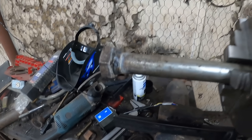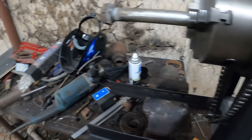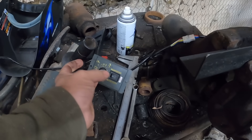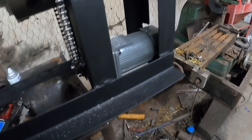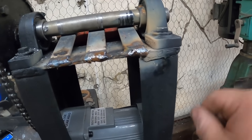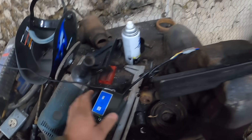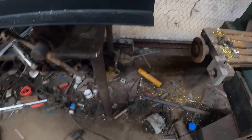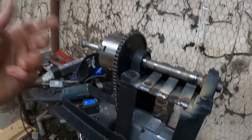It's a little cold and everything, but the weld looks terrible as far as appearance goes — however, the machine did what I wanted it to do. I should be able to just pick it up and carry it around and set it wherever. The only other thing I've got to do is get a box — the holes in the front are actually the same screw spacing as a light switch but it's a little bit wider than a regular box. I may have to get a couple of boxes and make one, or just weld a box right here and put that controller on it. It's got a clockwise/counterclockwise pin-out on the back, and I'll be able to mount a toggle switch for forward and reverse with a little pigtail plug, and put a foot switch so when you're welding you can just step on it to make it go, then adjust your speed depending on how fast you need to go.